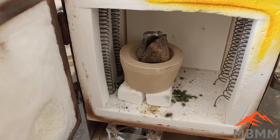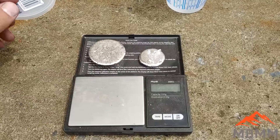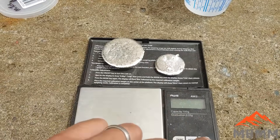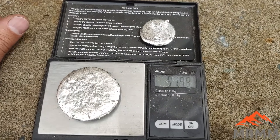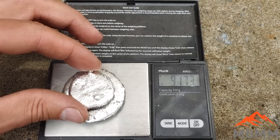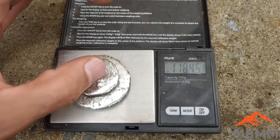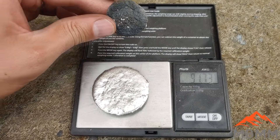Here's our last button in the furnace with some lead. We'll get her heating up and see what we can get. Here's our two beads — we got the first one I did here, and then this is the one that just came out of the cupel furnace. Quite a bit bigger, but let's get it weighed. The big one weighs almost 92 grams, and with both of them together it's a hundred and eighteen and a half grams — just under 120 grams. So there's our refined silver from all that stuff, but it's still got some black junk from the cupels on it, and this one still has just a little bit of oxidation left on the surface.